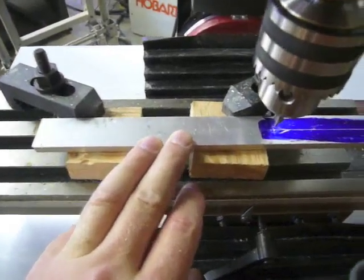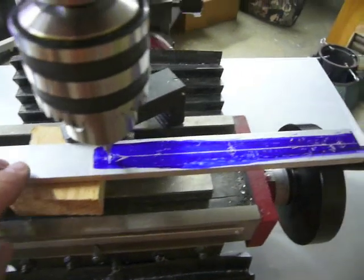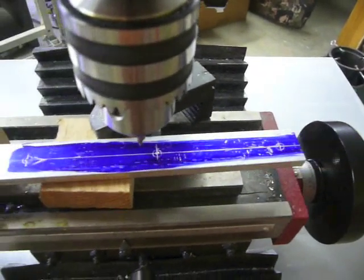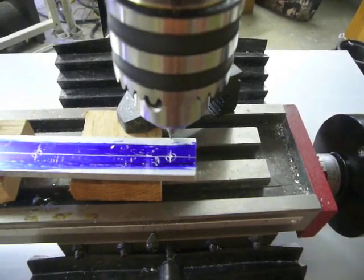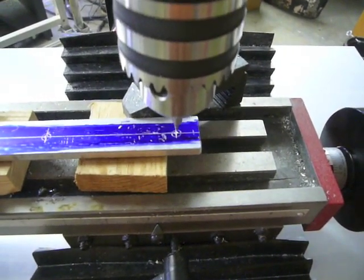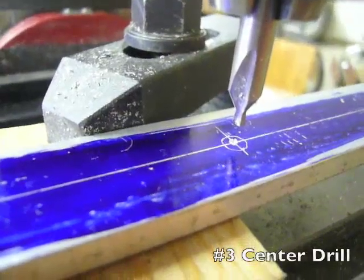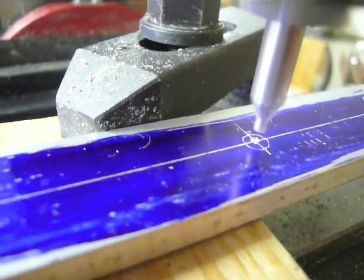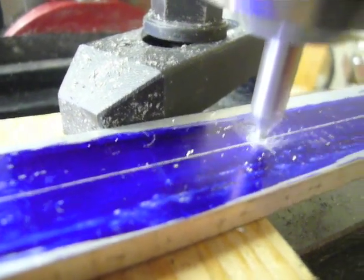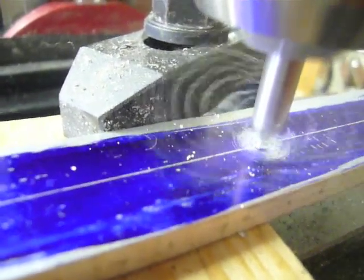Make a jig to locate the piece so that each hole will be drilled on the center line. Use scrap wood, clamps, bolts, a vise, or anything else that will make a sturdy and repeatable jig. Whenever you're drilling metal, it's a good idea to spot drill using a center drill in order to precisely locate holes. It's particularly important in this case since you're going to be using this piece as a guide for all of the rest.